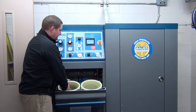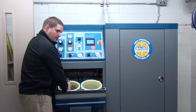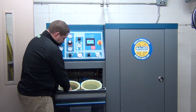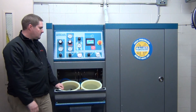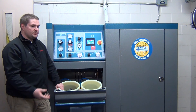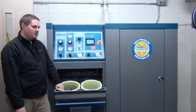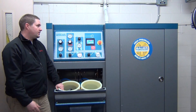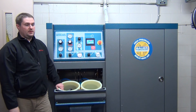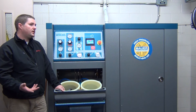The green button next to the red one up there — that's the on for the compressor. So if it's off and then you drop below a certain pressure, will it still automatically kick on? It should automatically kick on. That's just to forcefully turn it on. If there's no need for it to turn on and you hit the power button, it's not going to come on until you get below that pressure. The safest bet is to hit the emergency stop valve off or that switch up there if you're not going to be using it. But power compressors like to be run, so it's up to you if you want to turn it on or not.